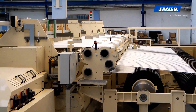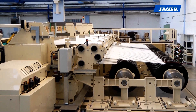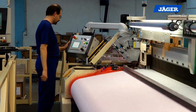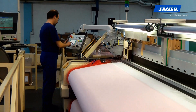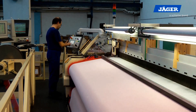The guide rolls are designed non-rotating with a chrome-coated surface. Optionally, the guide rolls are available in rotating execution. The BK700 is equipped with state-of-the-art control technology. Operation panels are provided on both machine sides. All weaving parameters are entered via a PC.